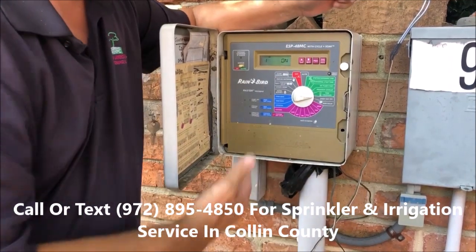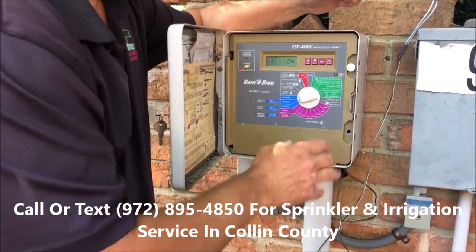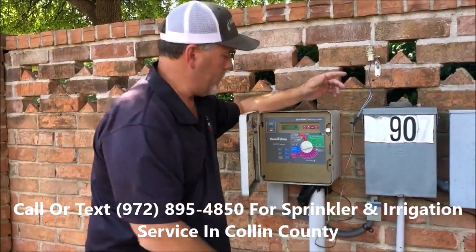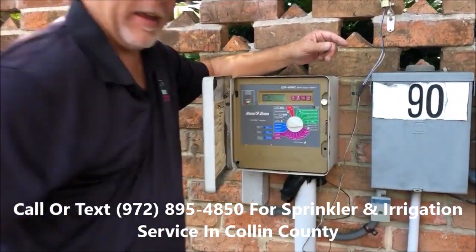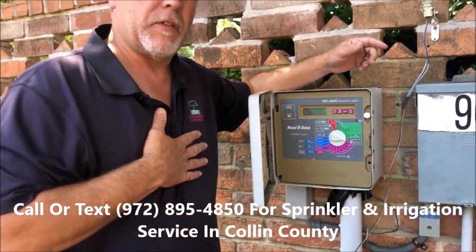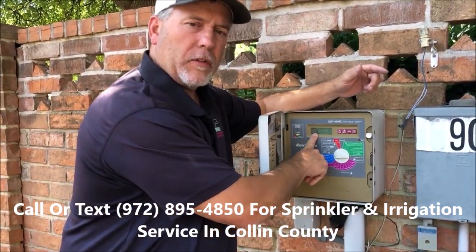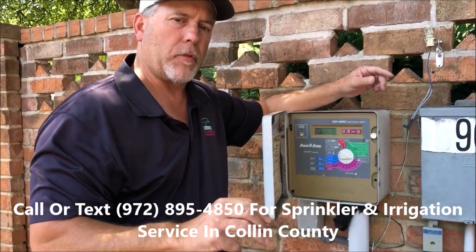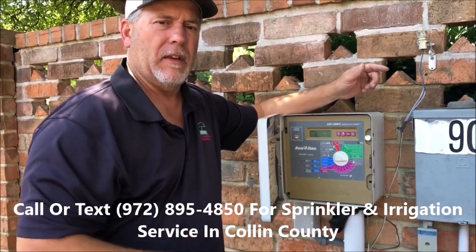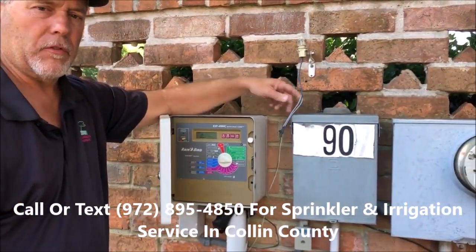The event day off — that's a commercial controller feature, you're probably not going to have that on your residential, but you could. It basically lets you turn off watering on a specific date, like July 4th. For rain delay, I usually don't use it on my personal house, but you can set the number of days you want it to not water after a rain — three days is typically pretty good this time of year. You also need to make sure you have a rain sensor on your home.